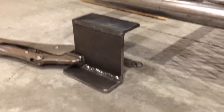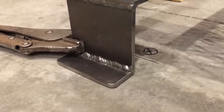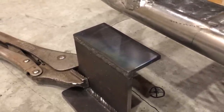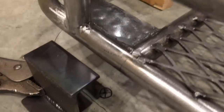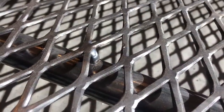The mounting bracket that will go on top of the vehicle has a bottom plate with two bolt holes drilled in it - perfectly round and spaced to match the holes in the top of the 4Runner. Up on the other plate I'll do slotted holes so I have a little play or adjustment once the bracket is on top of the roof. I can move the rack around to get it centered before snugging it down. The plate underneath will also have slotted holes, giving me wiggle room in a few different directions.